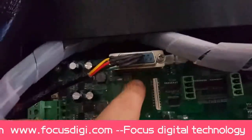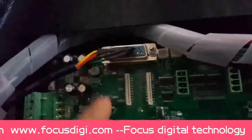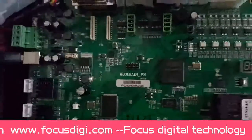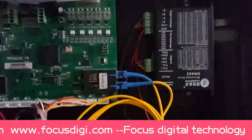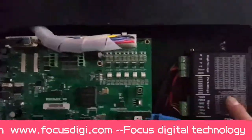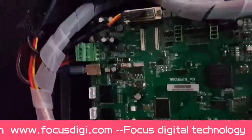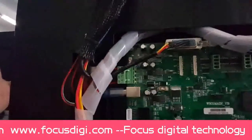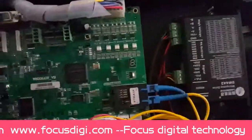And we go to here, it's written Y here, which is the signal for the flatbed motor. For this flatbed motor, the signal connects from here and goes to this flatbed motor, and it also transits to this relay to go to another port, to the rotary driver device to make contact with the rotary printing. So this line goes out by two different methods. One goes to the flatbed motion motor. Another one goes to the rotary printing device motor driver to control the rotary printing. It comes out from here.